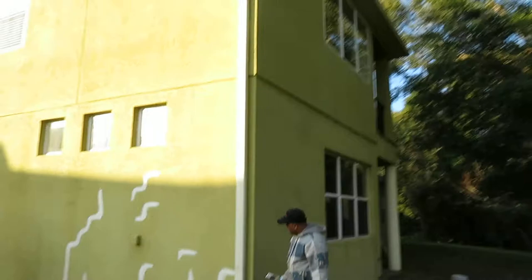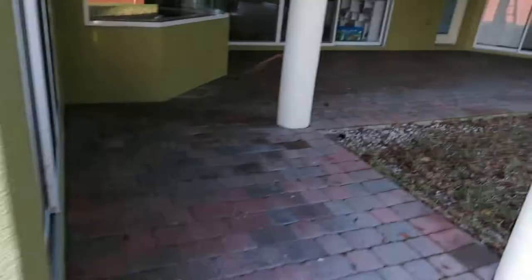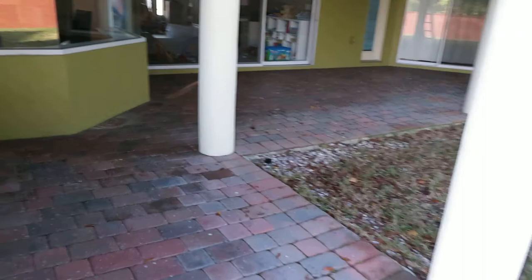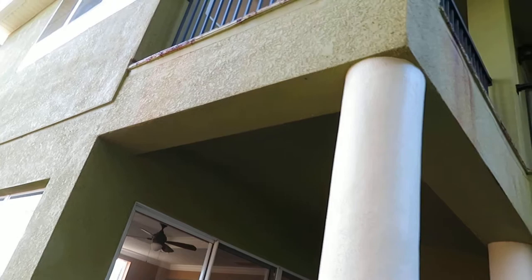Good size house, nothing really hard about it. But there are some definite issues here — you see this a lot on the edges of these window boxes. We'll put a really good industrial primer on that and kind of see if we can stop that rust from coming through. He's got that on quite a few of the windows. The real problem area is right there where that metal is, where that rust is at. He's got some really bad water-holding problems there that's causing all this metal to rust out. I mean, it is corroded, bubbled up really bad.